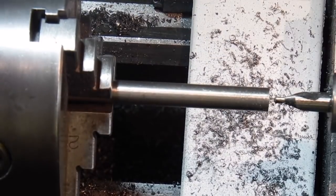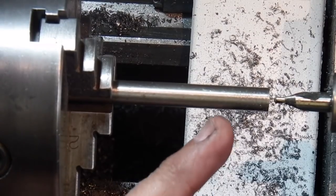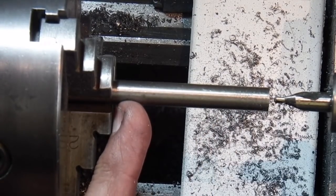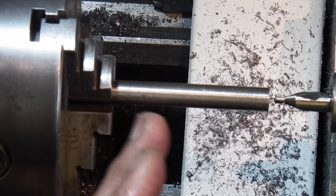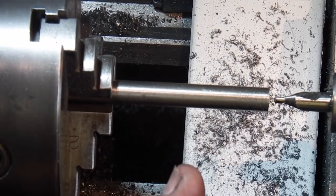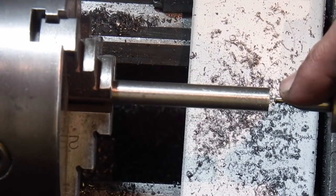This is a piece of silver steel held in the three-jaw chuck. I've just faced the end off. It's sticking out this far because I want to turn the whole length down to 8mm. I don't want to move it in the chuck once I've started, so on this end I'm going to put a centre drill in to steady it. The centre drill part will also be the female end of the tap support.